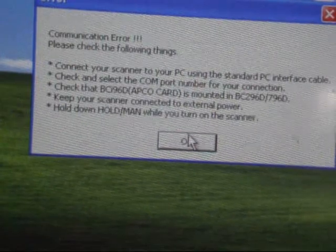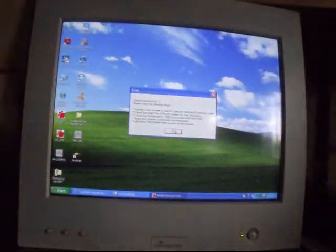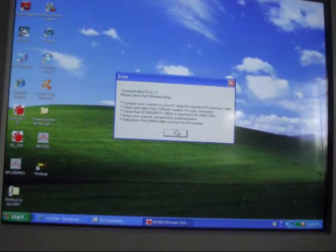One way is by holding down the scan, lock out, and six buttons while turning it on. Another way is by just holding the manual. And there are a couple of other ways — I think it's by holding down lock out and six. There are probably three or four different ways that this can be done, and I've done it all three or four different ways according to the different instructions that I ran across.